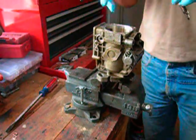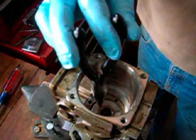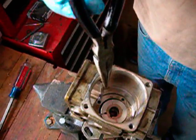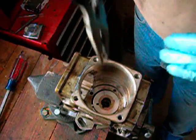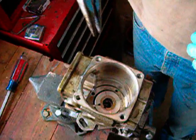As we look down into the pump, we can see the rest of the feed pump assembly. It consists of a rotor and four blades that sit in slots on the rotor, and also a liner that surrounds those parts. This is probably one of the trickier parts of taking the pump apart, because all four of those blades need to sit in their respective grooves — they can't be interchanged and they can't be flipped around — so we need to take that rotor out and maintain the positions of those blades at the same time.